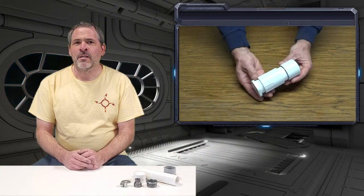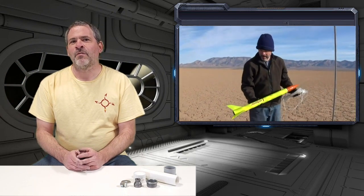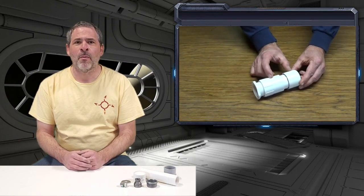When we started getting into amateur rocketry a couple years ago, one of the things I was trying to do was design motors made out of simple materials, cheap materials, and easy for just about anybody to build. One of the key components to that was PVC casing, as well as steel washers and rockite anchoring cement — all products that are inexpensive and easy to get a hold of. We had a couple of pretty good designs. Probably our most successful PVC motor was the Kiwi. We launched a couple of 2-inch diameter rockets with that. They went fine. It was a very small, not very powerful motor, but it was effective.